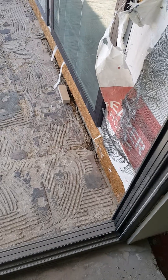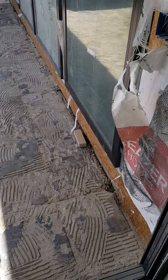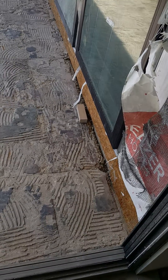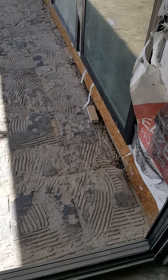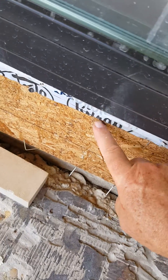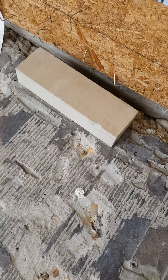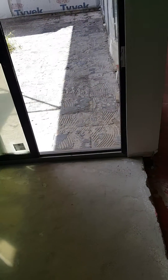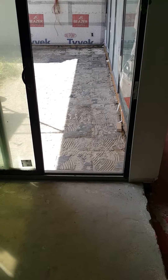The natural tendency of that water is going to be toward the lowest point, which is the interior floor. So here's the fix: we're going to take a tube of sealant and put a big thick bead — almost like deco seal, which you use around pools — and fill that crack in. Then we're going to apply RedGard or a liquid membrane that'll come down from the bottom of the window and extend out probably 12 to 18 inches, creating a solid waterproof membrane all along that wall so water can't migrate in.